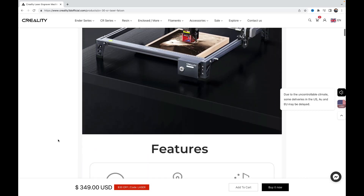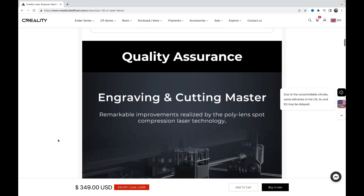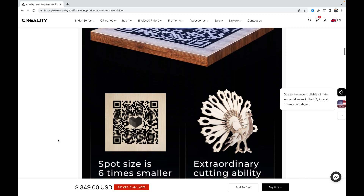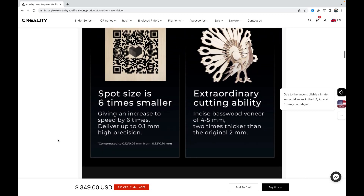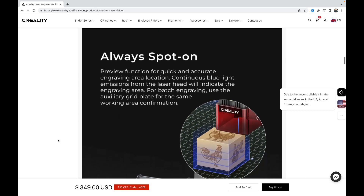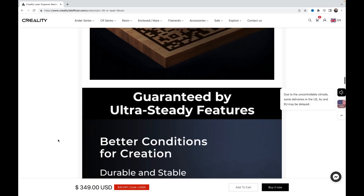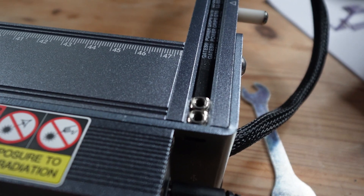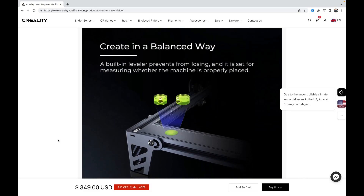The point of sale with this equipment seems to be around the 0.1mm high precision cutting and engraving, quick focusing, accurate positioning, smoke and dust filtering, and multiple support materials etching and cutting. The unboxing process was super easy, which is really why I shot this as a short at the start of the video — it doesn't take much to put a square of metal extrusion together and whip the belts on. I did really like how they added the grub screws to the T-nuts in order to keep the tension on the belt. It's a great idea and I might use that for something else down the line.